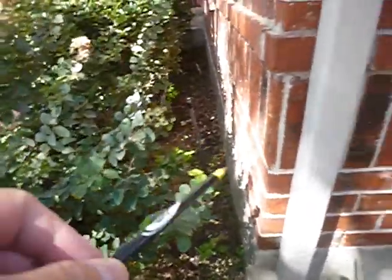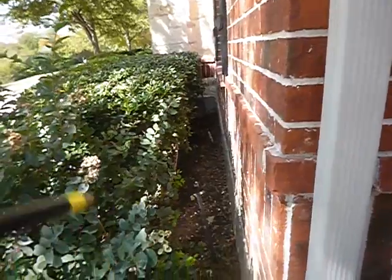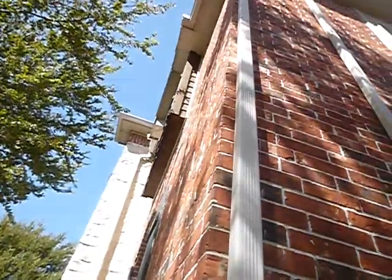These bushes are away from the house, so that's not going to make the wood destroying insect report — they're close but not touching. We do have debris: wood mulch and debris in the flower beds, and that is below the drain lines. That's conducive to wood destroying insects.